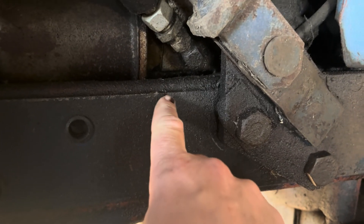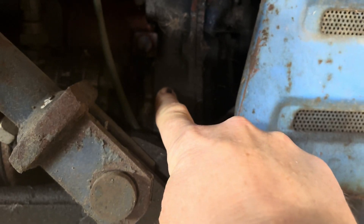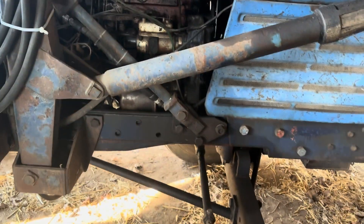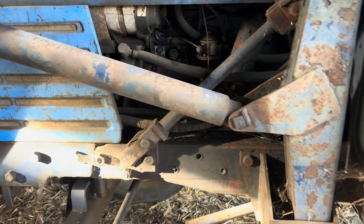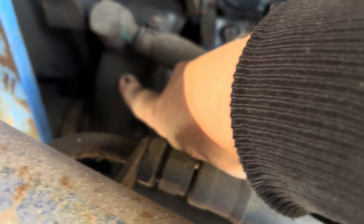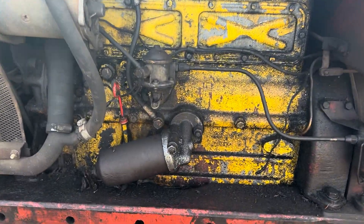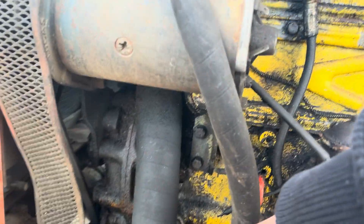This chassis has the recess in the side rail for the power steering pump, which bolts onto the casing at the front of the engine. Rotary fuel pump on the other side. You can see the oil filter faces up. The alternator is mounted on this piece here, which is part of the cooling system. Here the engine oil filter is mounted downwards, and here's the water pipe to the rad — and the dynamo is mounted here.